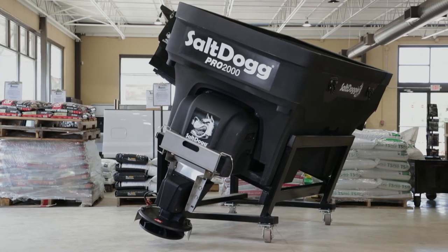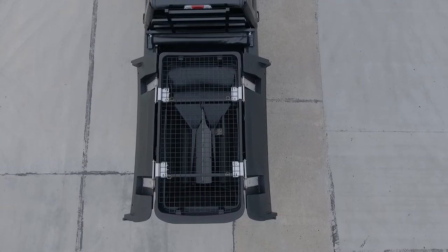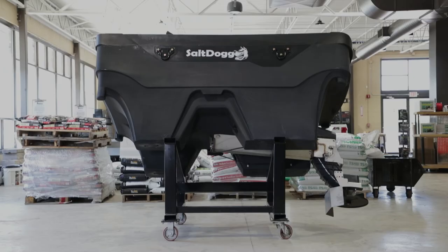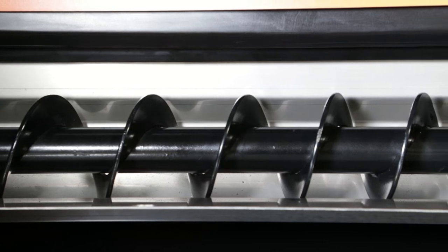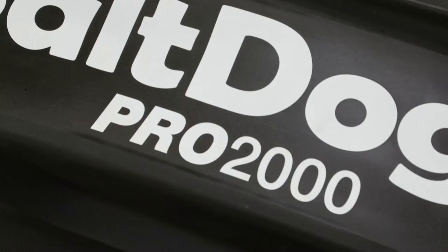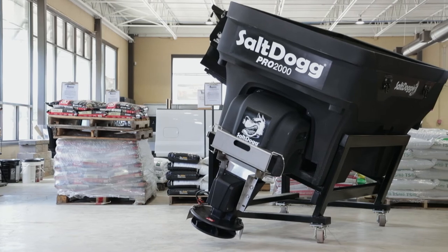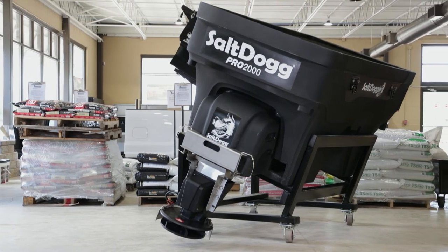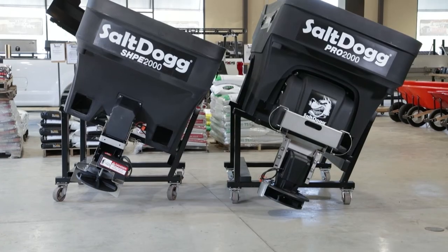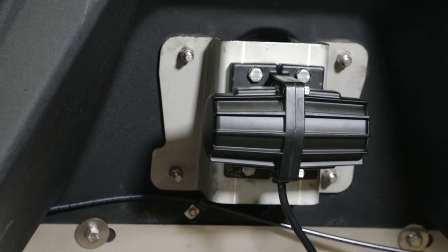Now let's talk about the driveline. While both spreaders come standard with a stainless steel inverted V to keep the weight and direct pressure of material off of the driveline, the SHPE series has a two-and-a-half-inch partial-length auger, where the Pro series comes with either a full-length 5-and-a-quarter-inch auger or a full-length 12-inch-wide pintle chain. This is all about the Pro having the ability to move more volume and thoroughly cover more ground. As a bonus, the chain models of the Pro can spread wet material like pre-treated salt or sand, which both tend to tunnel on most auger spreaders. Plus, certain sizes of both series come standard with a vibrator to keep sticky material flowing through your hopper.